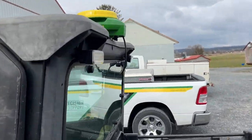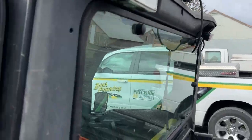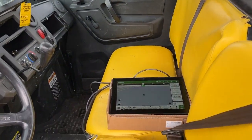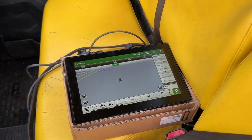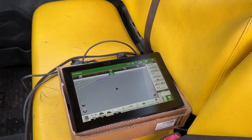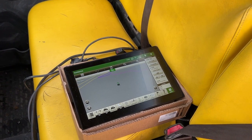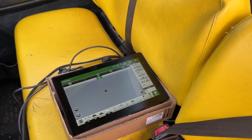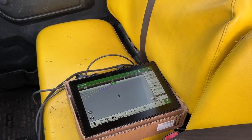Real simple setup. We ran the cord outside the window with an AgExpress AE3071 mobile mapping harness. We've got our display inside the cab — it just has a display connector and an on-off switch for power, run to the battery. We have a JDLink modem plugged in and powered up so we could send these maps directly to the op center.